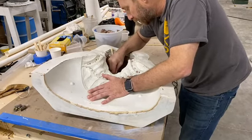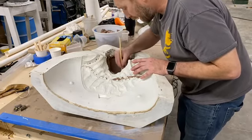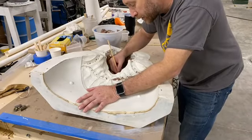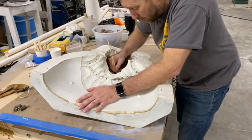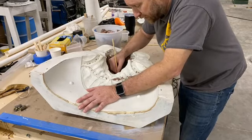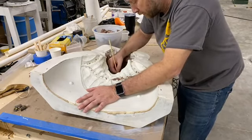You know, you get everything ready. This is a lot of the work part of it, but day-to-day production of pumping out a mask, once the mold is made and in the production line, you've got to mix the silicone, make sure you get it all in the right colors, and then you cast it, and then it's 2 or 3 hours before we even start looking at that mold again. And you can only have so many molds going at a time before you really start stacking things up. Also with silicone, we time everything so that it hits the paint room at the right schedule.